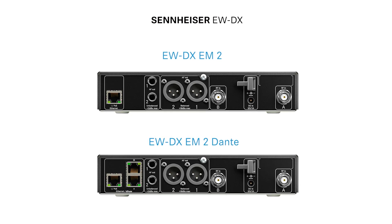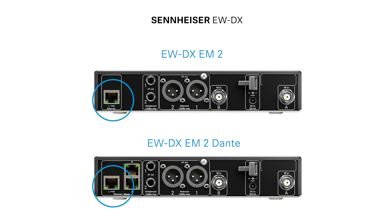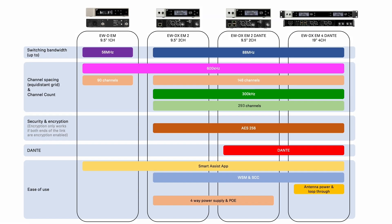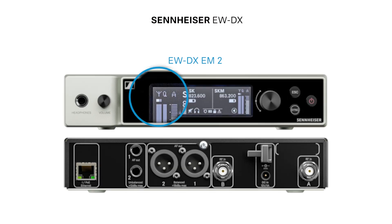We also need to mention the very cool addition to the EWD-X-EM2 of Power over Ethernet — especially for corporate and education settings this will be a great addition. On the EWD-EM we see an LED display, whereas with the EWD-X we have the added definition of an OLED display. And another plus with EWD-X, you will find a Q-meter just like we see on D6000 with its LQi meter, which shows us the quality of the link separate to the RF levels.